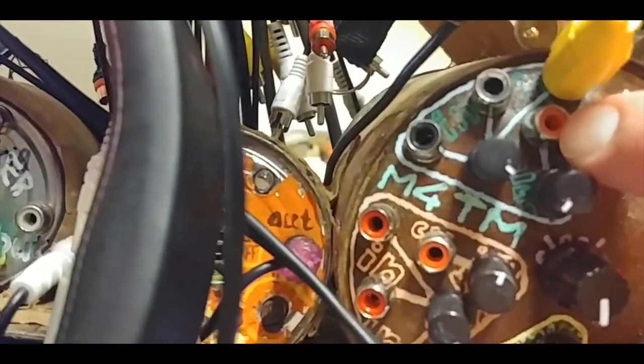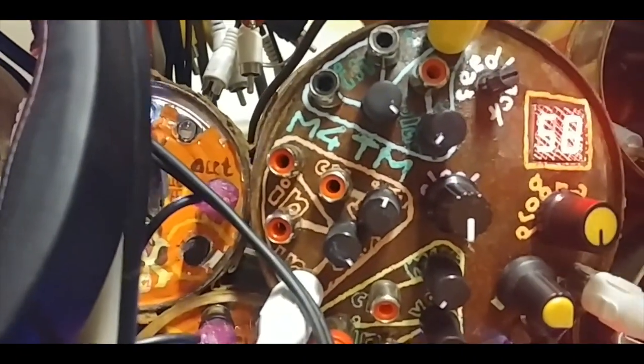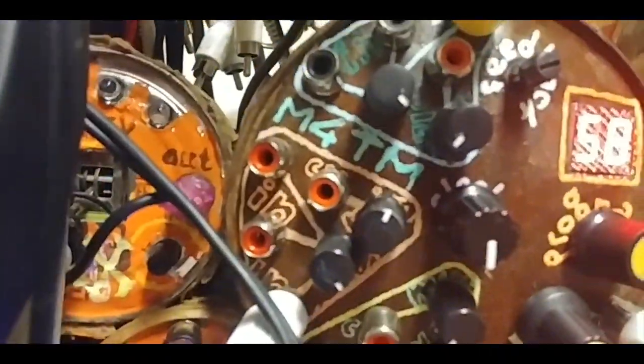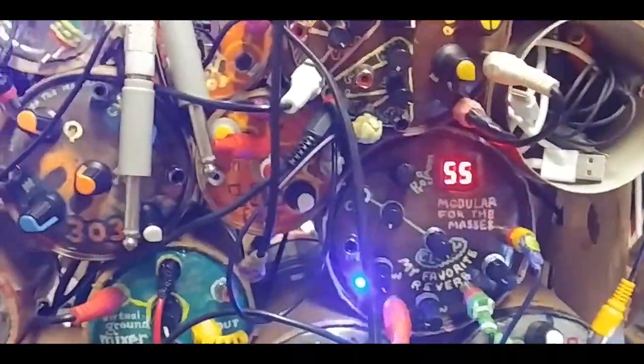This also has basically a little optical VCA inside there, where if you hit this with a voltage, it will change the wet and dry mix to send wet through. It doesn't attenuate the dry, but you know how King Tubby has every fourth snare hit have spring reverb on it or something like that. That's why I built that module that way.